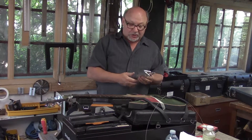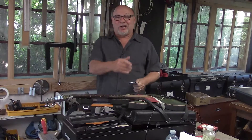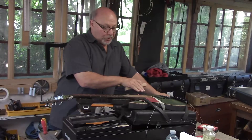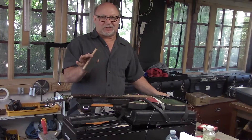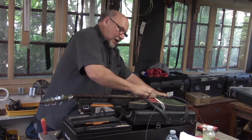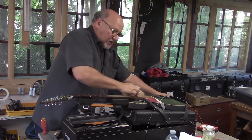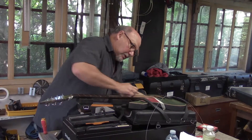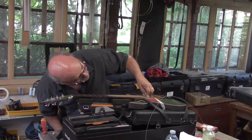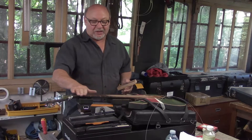We're really dealing with this immediate area at the neck-to-body junction, so I want to go just beyond that. That's how quickly — in real time — we took care of that high spot. Now I'm going to continue with a slightly longer block to blend back into this portion of the fingerboard. I'll go to a longer block next with a slightly lighter grit. I'm going to stop and check with the 17-inch radius gauge and see how close we are. It's still a little high. Now working towards the outside edge... and we have arrived — a perfect 17 up here. Now I'll switch to a longer block and work down to 14.